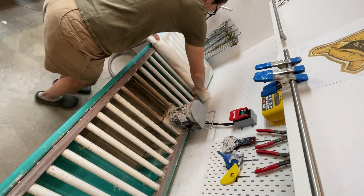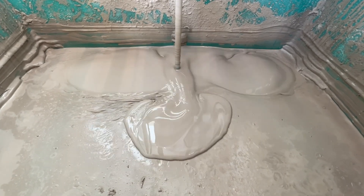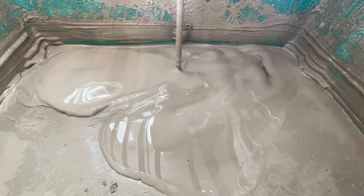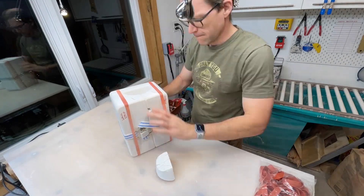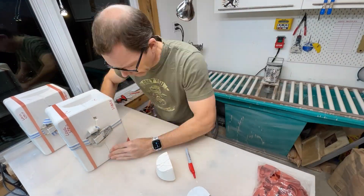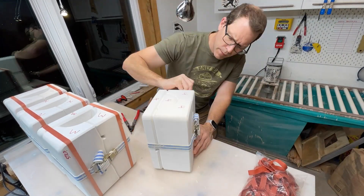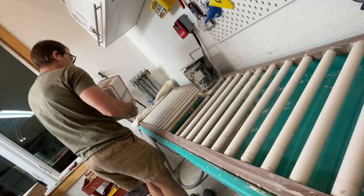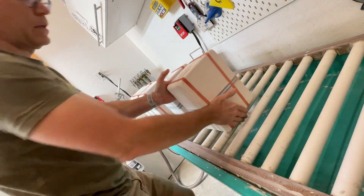Slip casting always begins by warming up the slip — I mix it for a good 5 to 10 minutes. Those negatively charged slip particles are still staying in suspension, but they kind of gel when they sit overnight, so I give it a good mixing to get things flowing like water again. Since this is the first time I have cast these molds, I need to put straps on them and also mark them — I number them to track which is doing what, and note which end goes up and which goes down. This mold needs to sit at a special angle while it drains. Once the slip is fully mixed, I stack all the molds onto the slip casting table and get ready to pour.